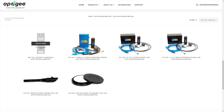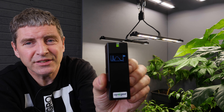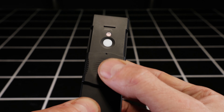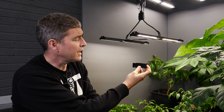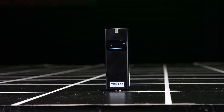It's a very nice, neat little piece of kit and very easy to use. It's got a little display screen here, as you can see. Just a quick test of the lights behind me — you can get a spectrum readout right there. The sensor is on the back, protected with a slide, and you've got a memory card and a USB connection. To take a reading you simply hold it under the light source, hold the button in, it takes a full reading with a beeping sound, and there you can see the spectrum output. It measures from 380 nanometers to 780 nanometers — all the wavelengths of light that plants use, from UVA all the way up to far red. It measures from zero up to 3,500 micromoles per meter squared per second, so you can use it as a quantum sensor as well.